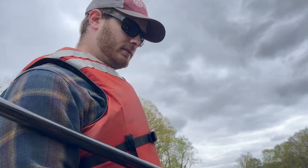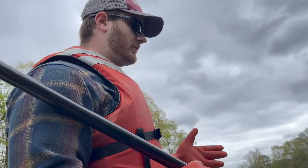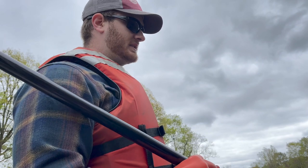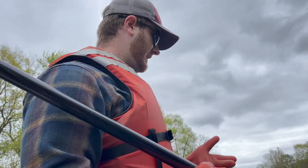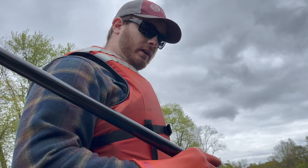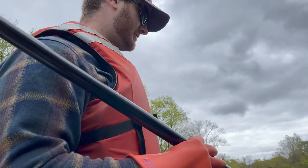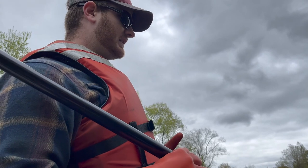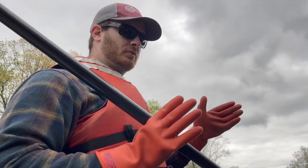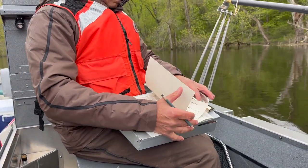And what makes you decide when to hit the pedal and when not to? So when we're just looking for a school of fish, we only want to sample intermittently, like press the button intermittently. And that way we don't have a constant field that fish can sense. Because if they do sense a field, then they're going to sense a little bit of distress and they'll swim away. So we'll put on the field for 5 seconds and that'll tell us if we're on any fish. And then we'll go off to try to move away from where we just had that last electricity discharge. In that sense, we can kind of keep ahead of the fish in terms of having them not sense when we're coming. And usually I try to time it so that we get about a boat's length away from where we last shocked, because that's about how far the electricity will go at its maximum reach.